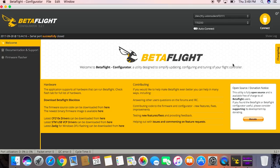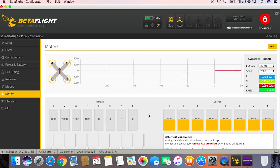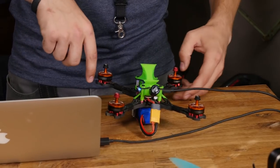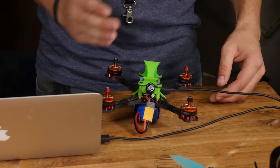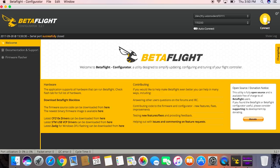One final step before flying: double check motor direction and make sure everything is spinning the proper way. With D-Shot it is not required to calibrate the motors. In Betaflight motors tab, click that you understand propellers are removed, use the master slider to get motors spinning, and verify direction. Bottom right is clockwise, top left is clockwise, top right is counter-clockwise, bottom left is counter-clockwise. Opposing motors always go the same way. Looks good — disconnect, turn everything off, put props on, and go outside to show turtle mode in action.